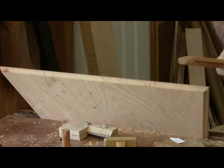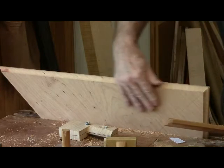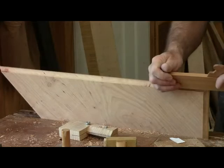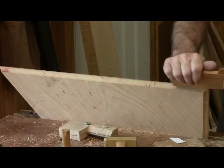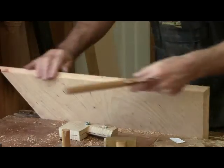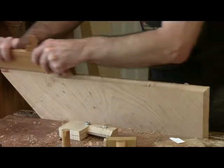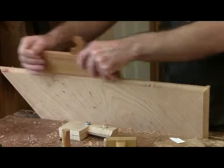So I've got one of my wooden planes here that I made years ago — this is a quarter inch hollow. The grain is going in the correct direction, and the set on the tool is pretty fine. This is all end grain here, although I'm going to follow the grain direction. You can see it's starting to round over.